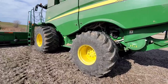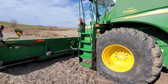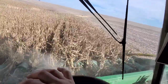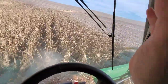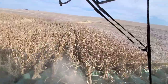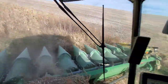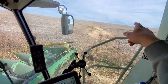And we're back from lunch. We're going to start on the final farm here. Right here, we're negotiating some pretty tough contour terraces. If you don't know what a contour terrace is, it's a terrace that lays with the contour of the ground — just a minimal amount of slope, and they always empty out into a waterway. As you can see, the waterway here goes down to the field. They're not made to contain water for tile lines. Here we'll cross the waterway. This is where the terraces outlet — they taper in. You can see the form here.